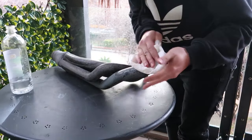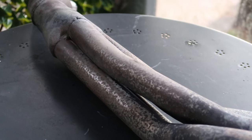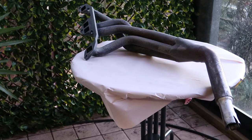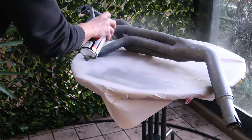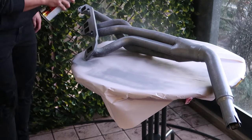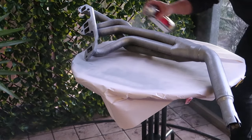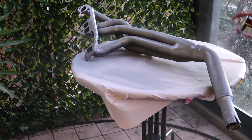After a quick wipe down, it's time for some paint. I'm using high temperature ceramic based spray paint, meant for manifolds. This stuff is required to be baked on. Since these extractors won't be going on the car immediately, I'll blast them with the heat gun.